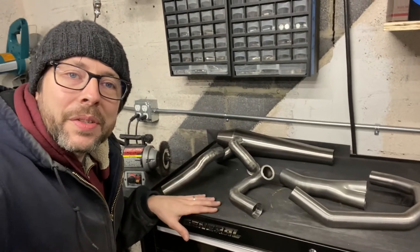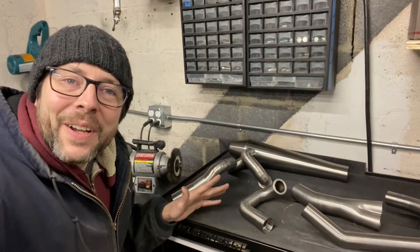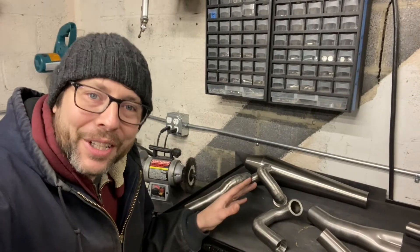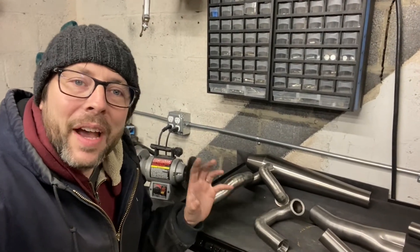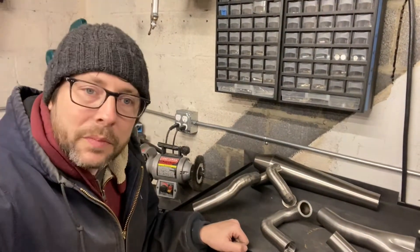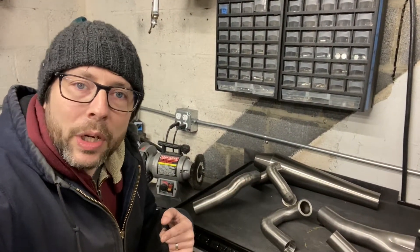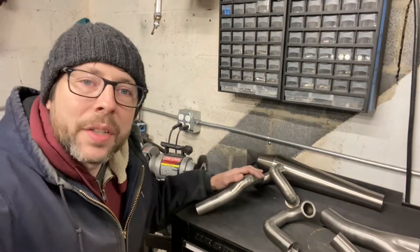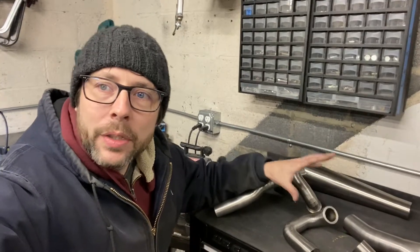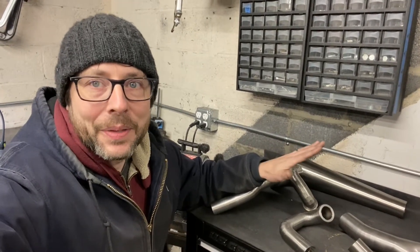Here are the four components of the exhaust system that I designed for this motorcycle. My approach has all been about minimizing the risk of screwing up the welding. There's about 400 linear inches of welding to do on here, and if I overheat the part or it warps and distorts too much, it's not going to fit on the bike again. To combat that, I'm using the pulser and low amperage settings on the TIG welder, and I broke the parts down into four components so I can weld each one individually and make small tweaks and adjustments as I go. That's my approach.